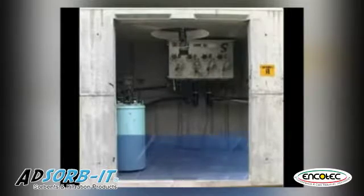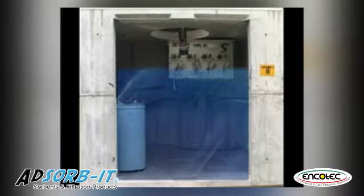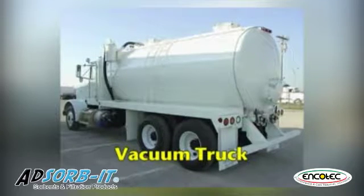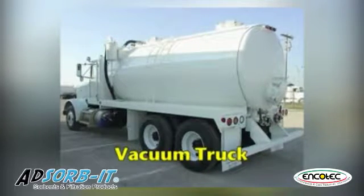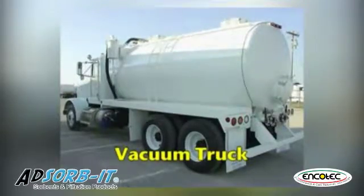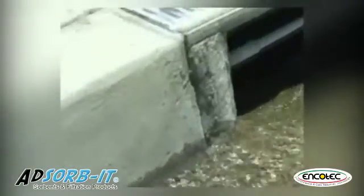Water levels in a vault can range from a few inches deep to completely full. And depending on the size of the vault, water volume can range anywhere from a few hundred gallons to thousands of gallons. Currently, vault dewatering can be both a very time-consuming and expensive process, using a vacuum truck to pump the water out, or potentially polluted water could be discharged directly into storm drains.